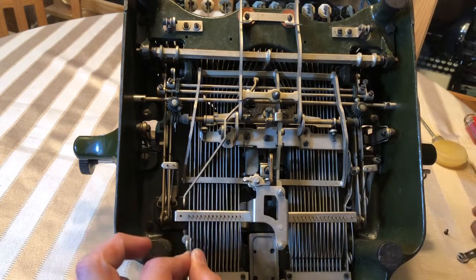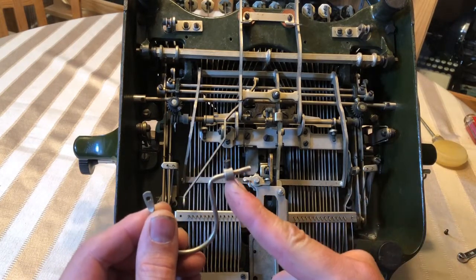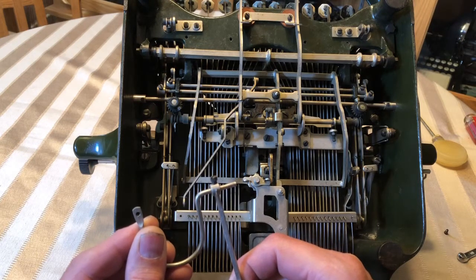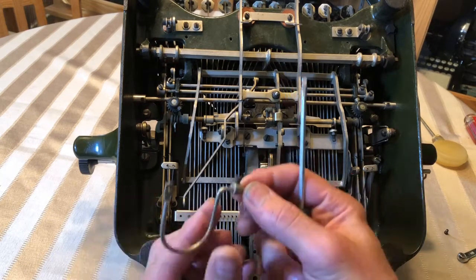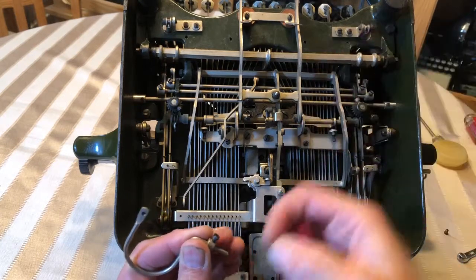Okay, so this comes out, and it's this piece right here. What I found is if this collar is adjusted too far down, it will make it so the tab doesn't function quickly. And if it's adjusted too far up, that tab will have no real break. I try about a sixteenth of an inch at a time, and it seems to work pretty well.